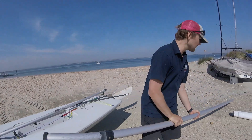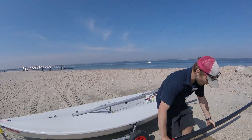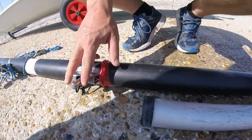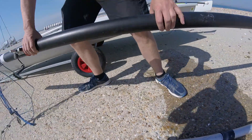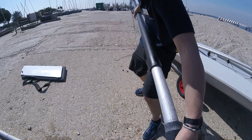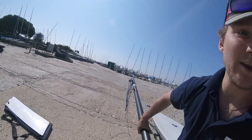I'm going to lay the top section on the floor for the time being — I've got lots of space today, but you can rig on your boat, whatever the space allows. I'm going to go for our standard bottom section. What I want to make sure is that this rivet, or red arrow, lines up with this gooseneck or kicker at the bottom — that will make sure my masts are all in the right line. They're designed to bend a specific way, so we want to get that right. Just give it a bit of a wiggle if it's tight, then double check that the rivet and equipment at the bottom are still lined up nicely.